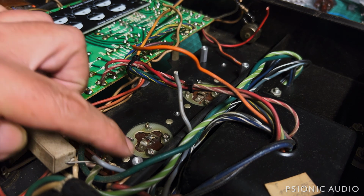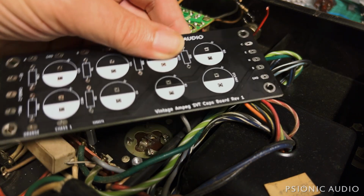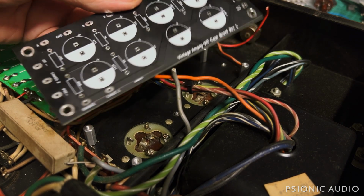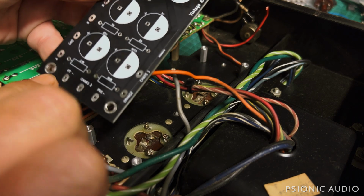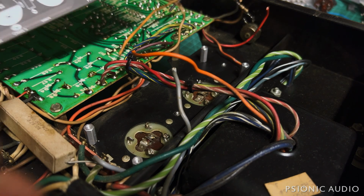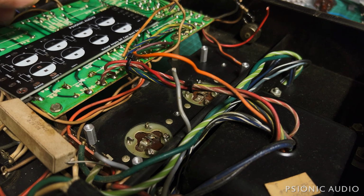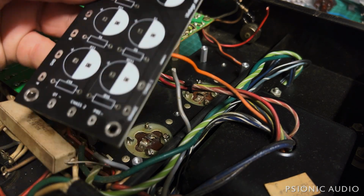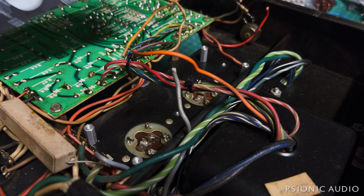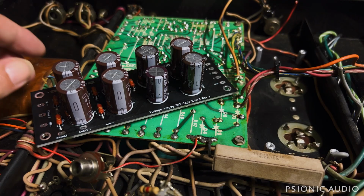And for those wondering how I got these in here to exactly line up with this, since I created this, I had the actual dimensions in a PDF, and I was able to print out the footprint with crosshairs showing exactly where these go. And since there are these caps here, I just cut that out of the paper where those caps would be and used some double-sided tape and was able to transfer the center points very accurately. And those center points will stay the same with the 6x32. So this will go back in very soon. This just makes me so happy.